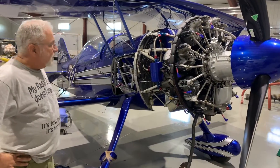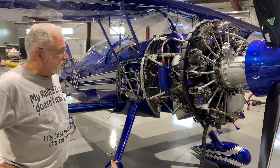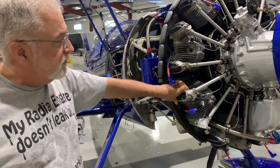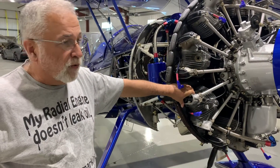Welcome back to Paradox. We flew all last summer, and we were running a little bit hot on number seven. You can see that we have the valve covers off here. On cylinder number seven, when we did our annual this year, we had pretty much no compression.